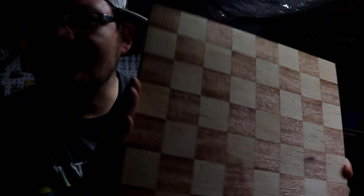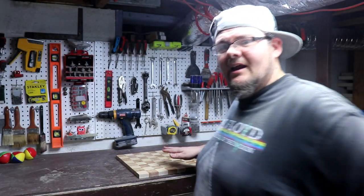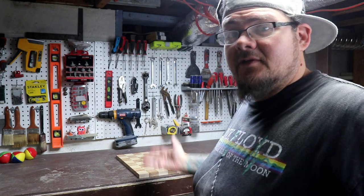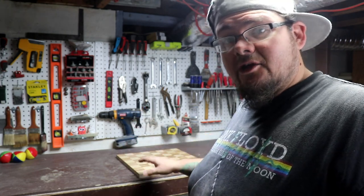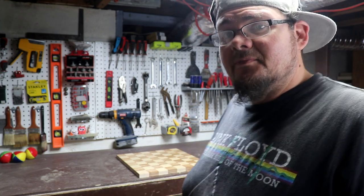We've really brought out the color in these grains — the mahogany looks beautiful, it really shines. I'll let that dry for about an hour, come down and throw a second coat on, let it dry another hour, then throw a third coat on, flip it over and do the same. I'll be down here off and on for the rest of the night getting coats of danish oil on both sides. Then we'll let it cure overnight, get in here tomorrow, get this framework on, get this thing finished up, and then I'll let you know what the name of it is. See you guys tomorrow — peace out.